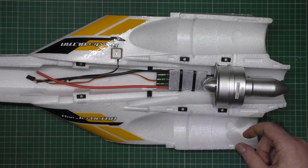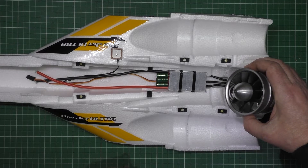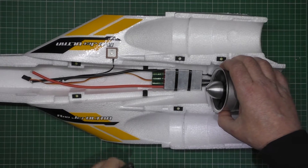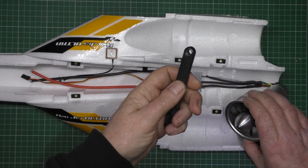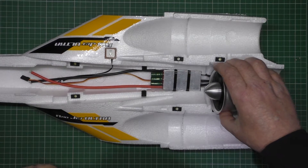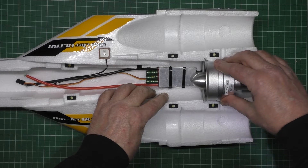I've had to fit the EDF. Now this EDF, although it says it'll accept 64mm, it didn't quite fit properly — it won't go down far enough. So what I've had to do is just get the back end of a knife and just push the foam in, just so it goes down a bit further, because it is a bit too big for it.